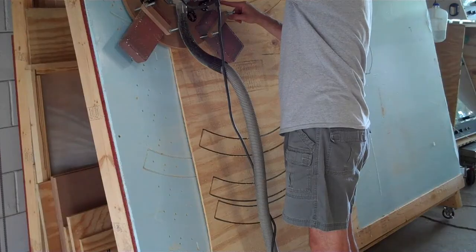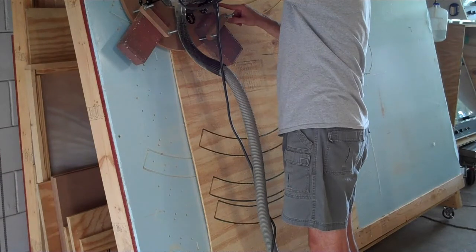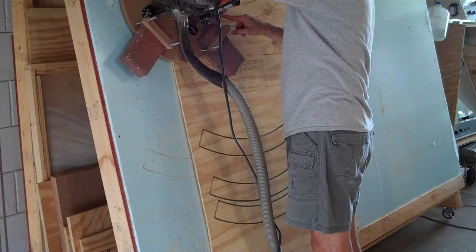In the same way, if you get your sled near the edge of the workpiece, it may fall off the edge and tilt the router bit unless you are holding one side down manually. So although you can put a 4x8 sheet on the frame, unless you build a skirt of the same thickness around the workpiece, you can't cut all the way to the edge.